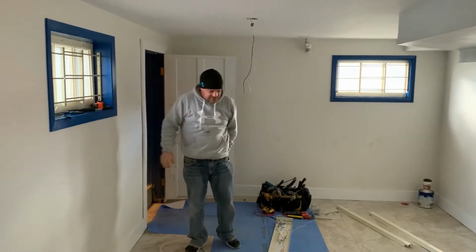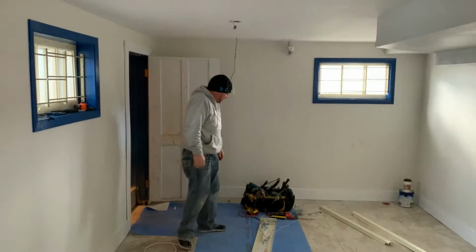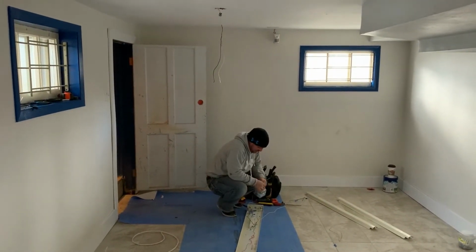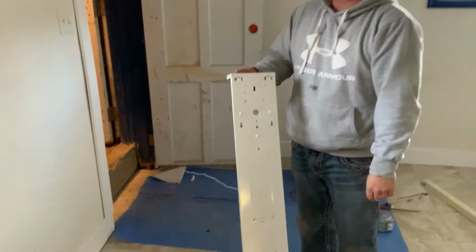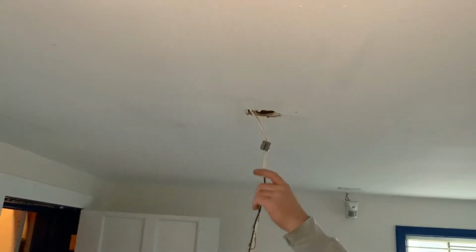So we'll get that straightened out and sorted around. Now I'm going to try to put these fixtures up without the aid of my cameraman. So we'll see what we can do here. Get some screws to get the light fixture started. So you want to come up here closer, Nick. We'll show in the back of the light that there's a 1/2 inch knockout, and then up here in the ceiling there's also a connector where it's going to go into the knockout.